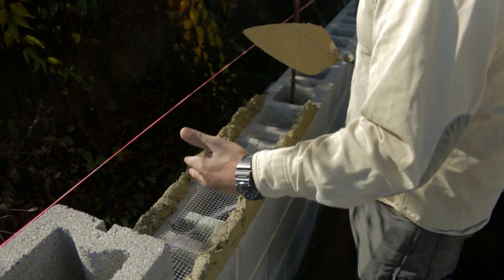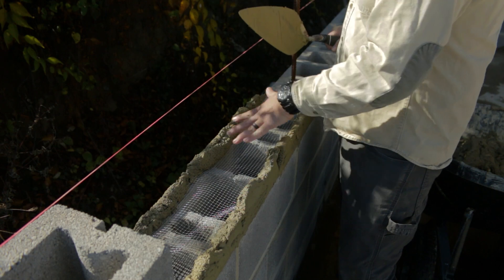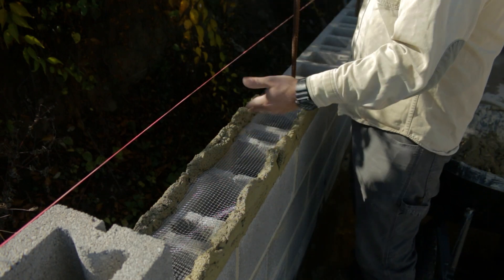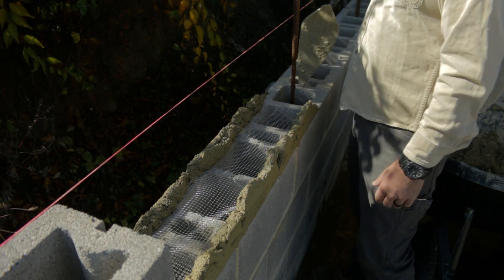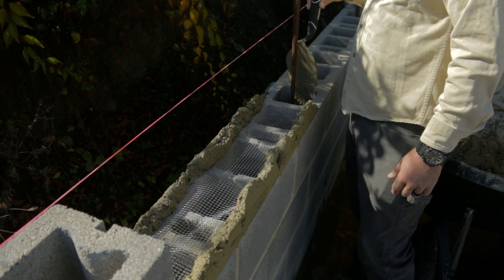So there you go — it's not going to be perfect. You might need to hold it down a little bit as you go to kind of keep it in place as you trowel down. But this is the way it looks, and we're just going to keep going like this. Make sure that you leave these cores all the way open, because that cement needs to go all the way down through.